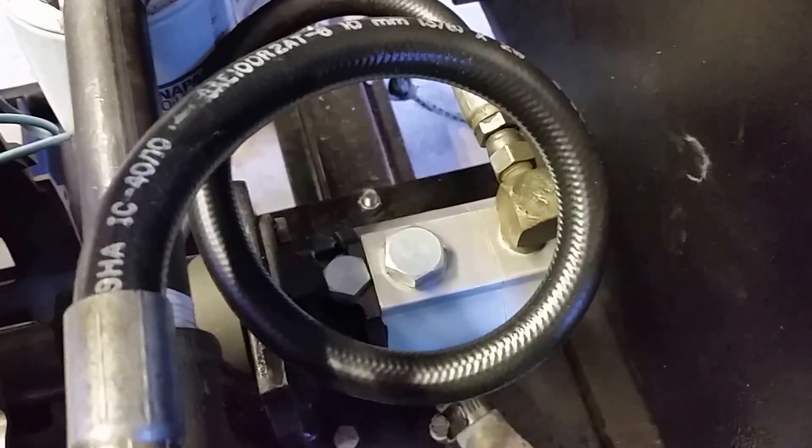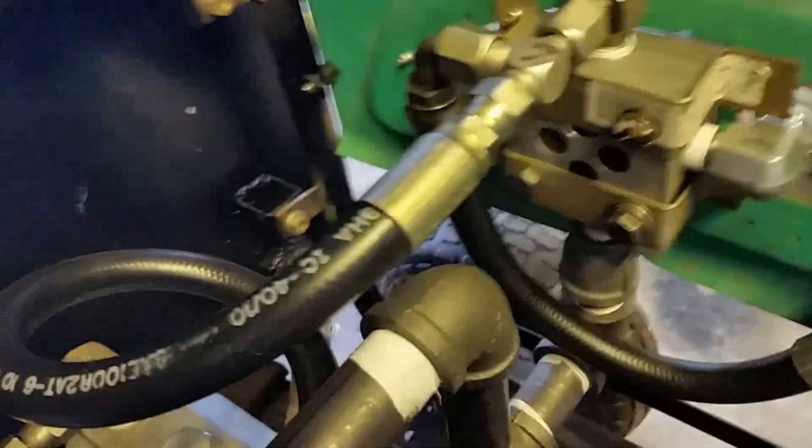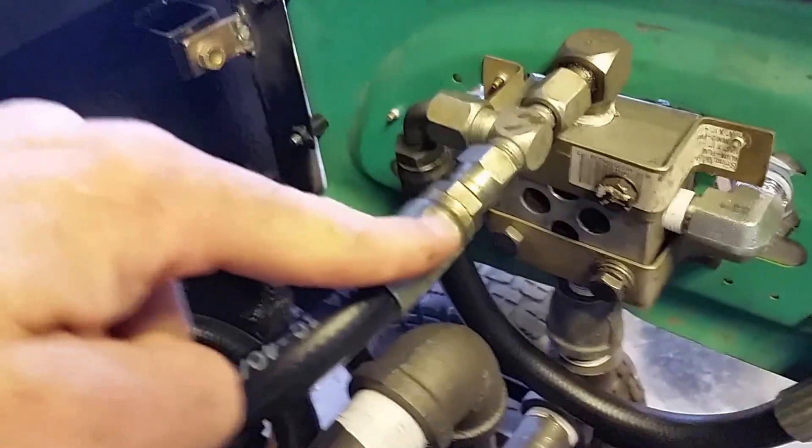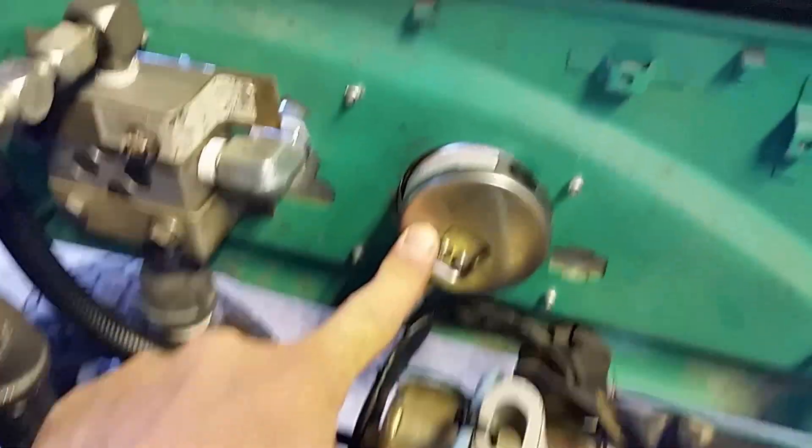This is a 13-gallon-per-minute pump. I didn't have a short hose, so I just had this hose wrapped around — it comes up and goes into the valve right here. You can see what I've done on the valve: here's the line coming in, pressure in, and then you've got the two outlets that have the quick disconnects hooked on. I also put a tee in here, and this runs over to the back of the pressure gauge.